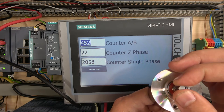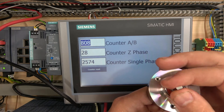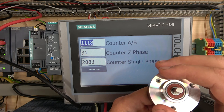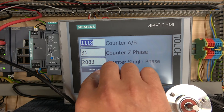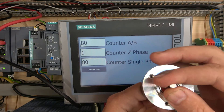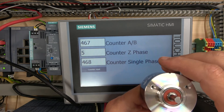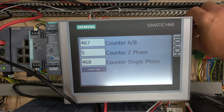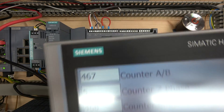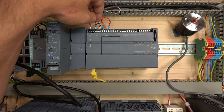With A and B I can go backwards and the controller knows I'm going backwards and forwards. With just single phase, you cannot detect direction. As you can see we've circulated 31 times now. Let me reset the count back to zeros — when you spin everything looks good. Now, what happens when a controller is set up to accept A and B — let's explore that.